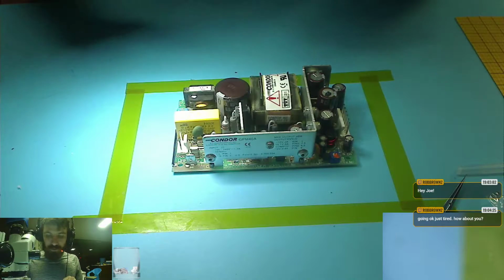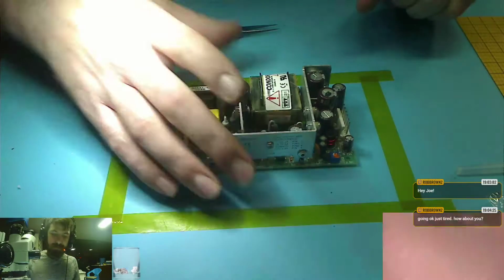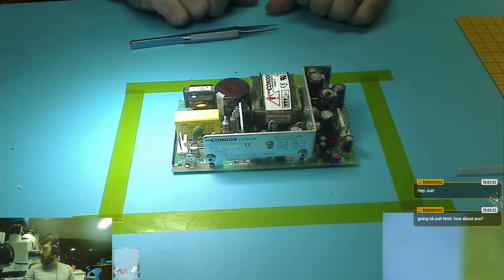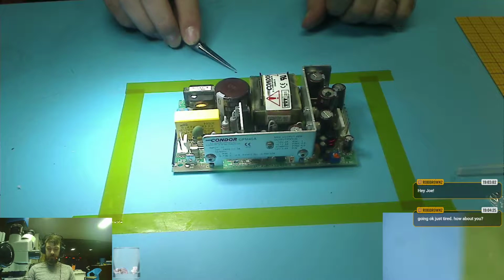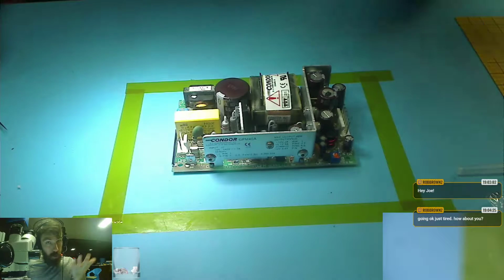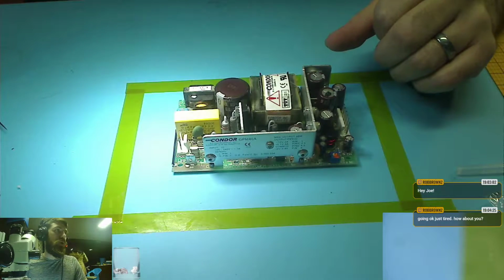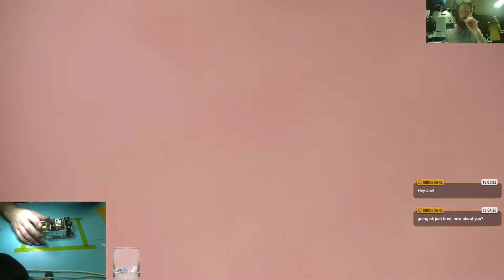Okay, so why am I going to rant about tin-based solder, or solder that does not have lead in it? Well, we all know it's brittle, and we know that there are quite a few problems caused on MacBooks by poor solder joints. Did you know it exists in medical equipment as well? I've been seeing a lot more of this recently, and I don't know why. So let's show you what I've seen. First off, this is for a Force FX electrosurgical unit made by, well, too many companies have bought the company out now, so I don't even know technically who the owner is.